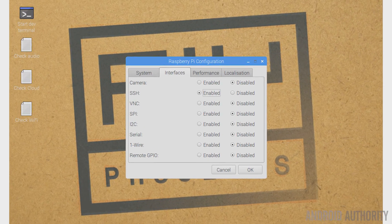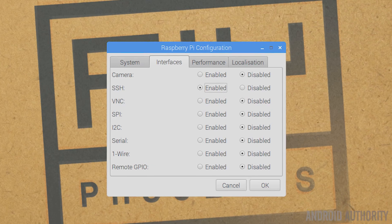While you're there on your Raspberry Pi, you also need to configure access to Secure Shell. Do that by going to the menu, finding the Raspberry Pi configuration program, going to interfaces, and making sure SSH is enabled. You also need to make sure your network is configured — go to the Wi-Fi icon in the top right corner by the clock and configure your Wi-Fi network.